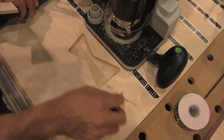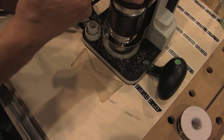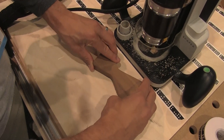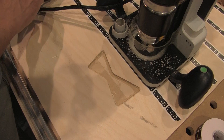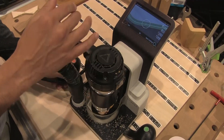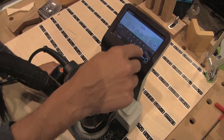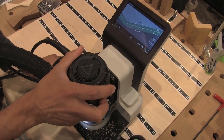We cleaned up the edges a little bit. Since we used the same file and did an outside cut and then an inside cut, if we used this exact shape and tried to put it in we wouldn't be very successful — we'd have an interference fit. So what I'd like to demonstrate is the repeatability of making the cuts and a nice feature where you can just shave off a little bit of material. You can keep working up to your final finish all day long, no problem. We're going to do a little offset — here we'll choose to take off maybe 15 thousandths of an inch, which moves the cutting path just marginally, and then we'll go back in and clean that up.